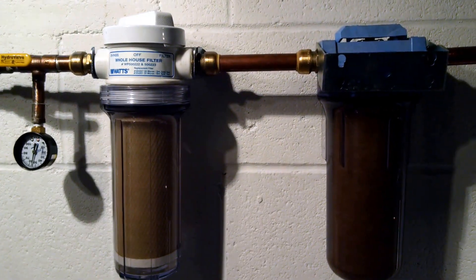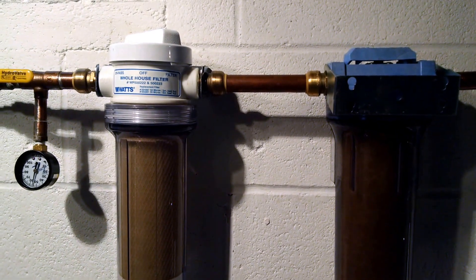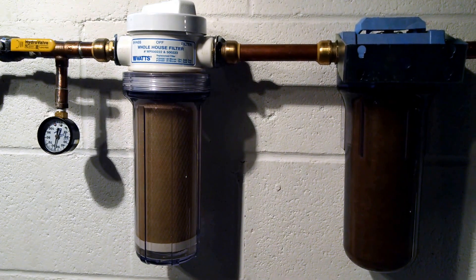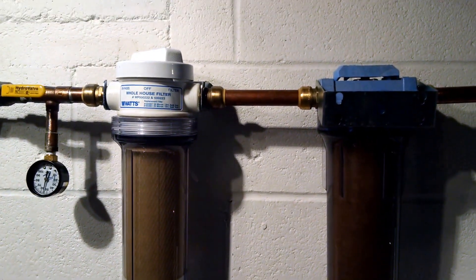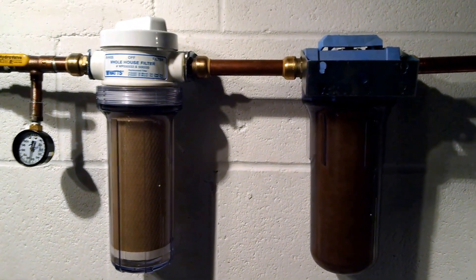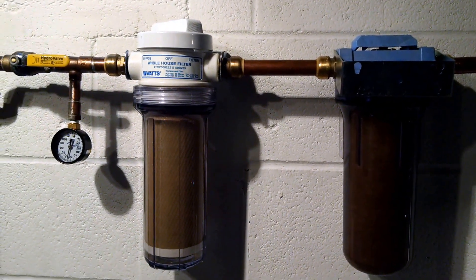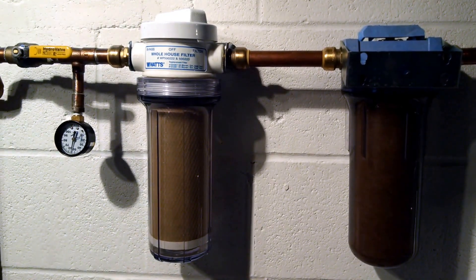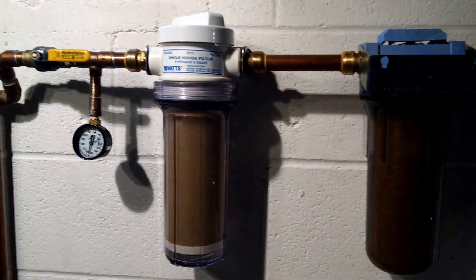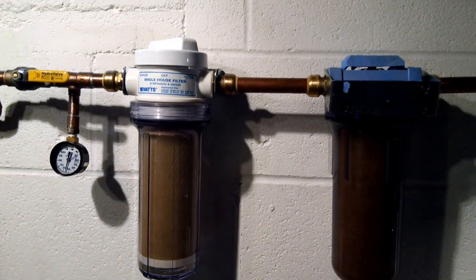The final stage is an ultraviolet-C germicidal filter just to inactivate viruses. It seems a little overkill, but when you're dealing with shallow water it's possible to get intestinal viruses — they survive in water quite well, especially if you have neighboring septic systems. Reverse osmosis should theoretically be enough to block out viruses, but it gives you one last layer of protection. I use that water for drinking, cooking, and pets — it filters out salt, bacteria, heavy metals, radionuclides, and many other things you might be concerned about.